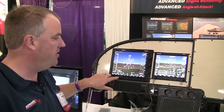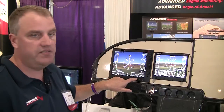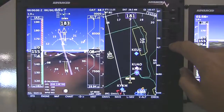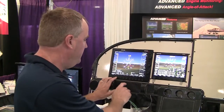For example, we can turn on and off the map with one button. We can turn on and off the engine. All the nav sources are here — the lateral navigation, course heading. If you want to adjust the altitude bug, you push one button, this knob becomes it, or you can manually enter a value. You can put 5600 feet, hit enter, and it'll enter direct. Making it much simpler for the user.